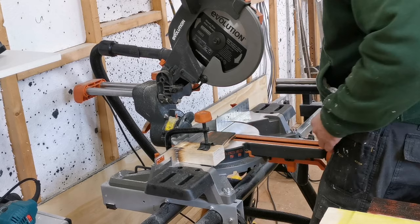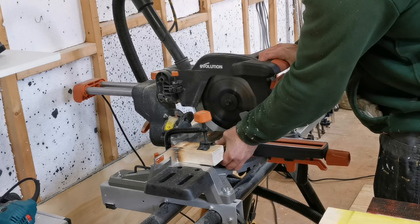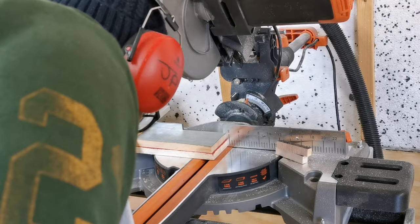So I got there in the end. Now I'm just going to make a first cut on this first piece, which was the smallest one. If you put the stop block on like this guys, just make sure the blade stops before you start to exit the blade out of the cut, so you don't get any kickback.